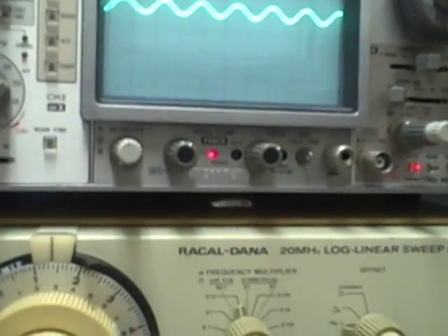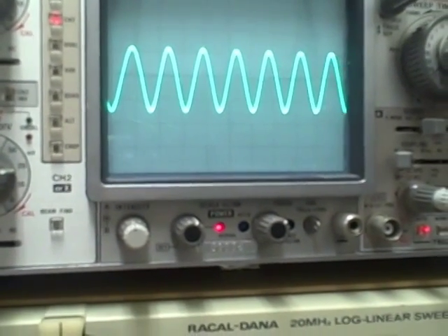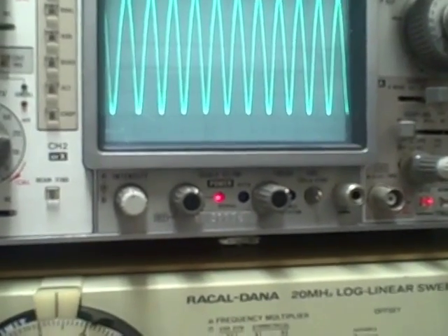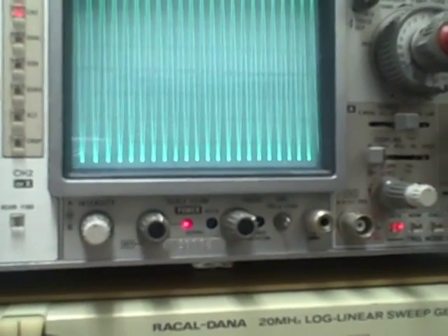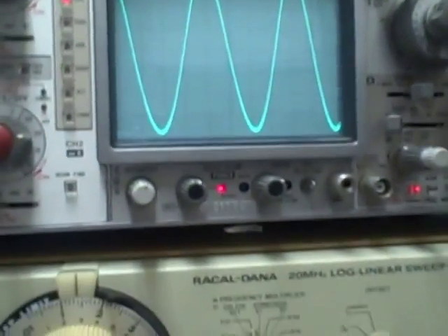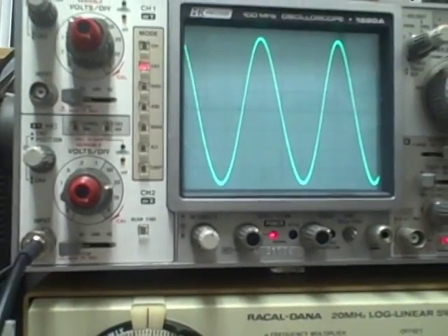Finally band F: starting at 32 megacycles and working our way to 110 megacycles. Approaching mid band, then heading towards the upper end at 110 megacycles — that would be the maximum. There we are — 110 megacycles and it looks pretty good. So we've scanned from 100 kilocycles up to 110 megacycles, you've seen the waveforms, plenty of signal strength, and we track the frequency very well with the vernier.